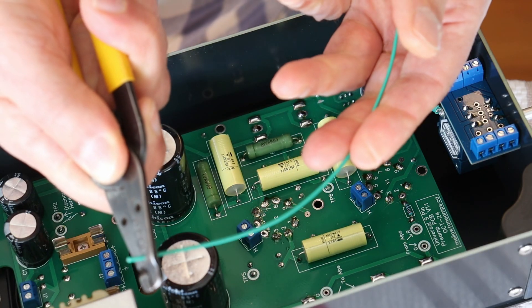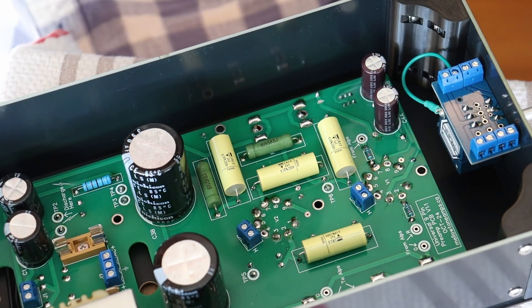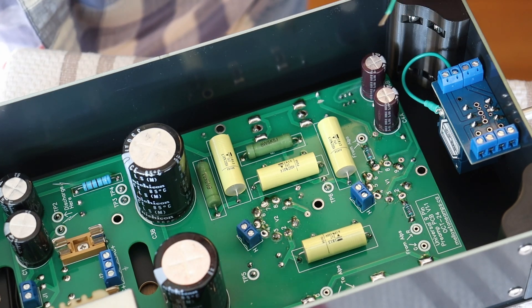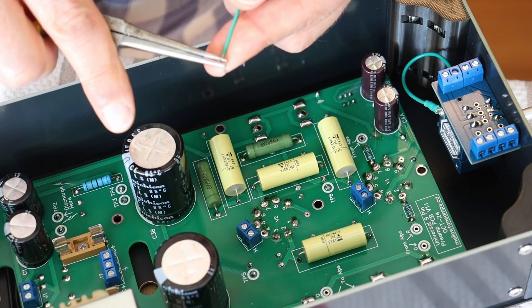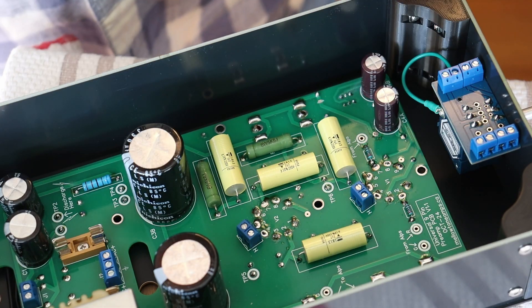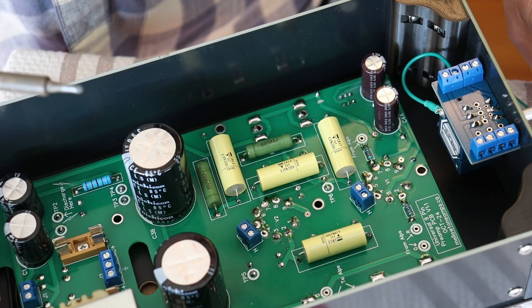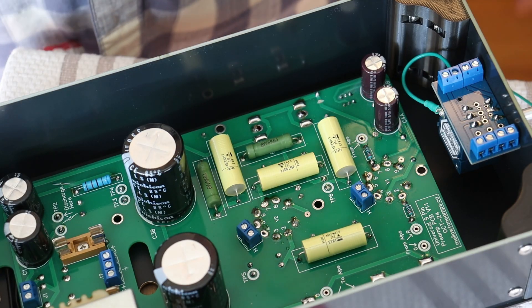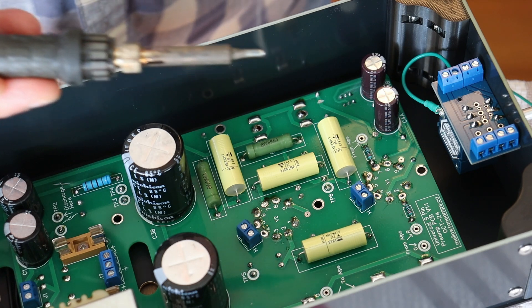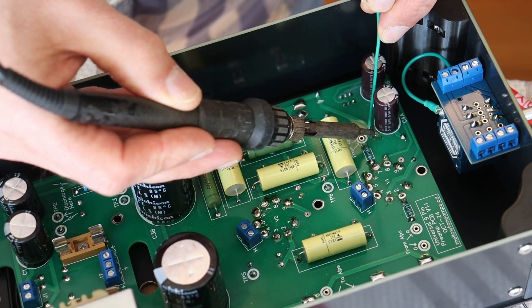You just take a little bit of your ground green wire — this is the solid core wire, though if your kit happens to have stranded that's fine too. And what you would do is you just make a little bend like this. You would pre-solder down here, finish up your solder pad right here, and then put a generous amount of solder on your tip and just come in and drop this on top of your finished pad like that and solder it in place.